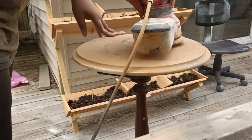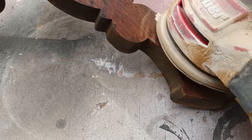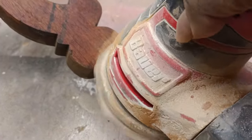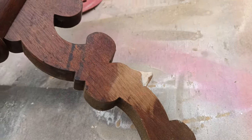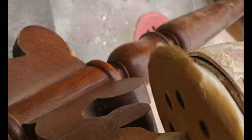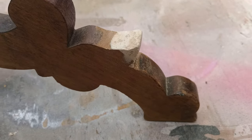I wasn't sure if I was going to do the tabletop, but I just decided to go ahead and do it using 220 grit sandpaper. I know I'm going to be painting over it, so I didn't know if it was worth my trouble, but I just decided to give it a clean look anyway, as well as the legs. I went ahead and sanded all the legs down, including the undamaged one, because I'm going to do a fresh coat of stain on everything. I did have to lower the speed on my sander to get into some of the tight areas, but it worked out.